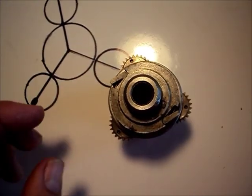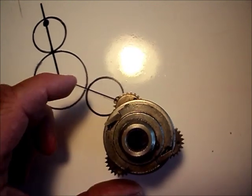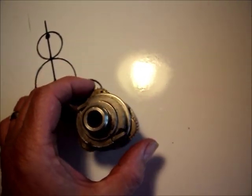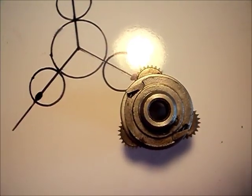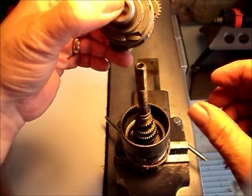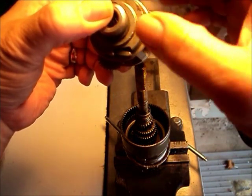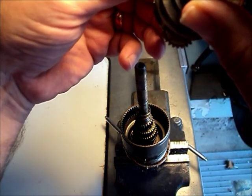The way I do it is I turn all of the alignment marks to the right, just to the point where they're going to disappear into the planet cage, and ensure that they're all in exactly the same position — ensuring that all of the timing marks are in precisely the same alignment.